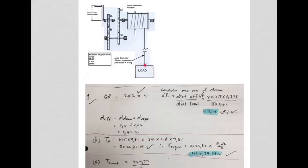So right here the tension in the string or the rope is that much. But there's 34 meters of rope and the rope has a mass of 1.8 kilograms for every meter. Multiply that by 9.81 to get the weight per meter. And of course, times the 34 would give us the total weight of all the rope hanging beneath the winch